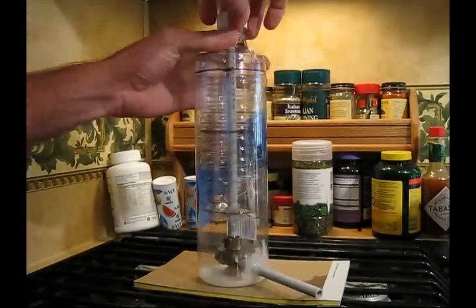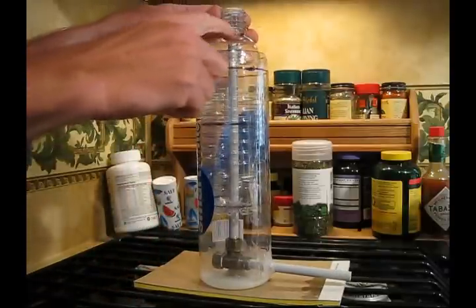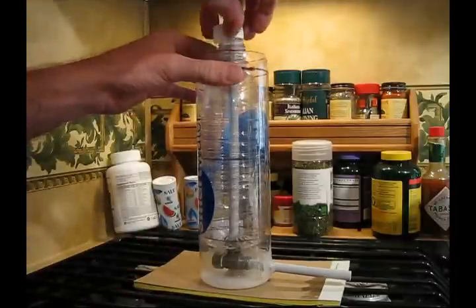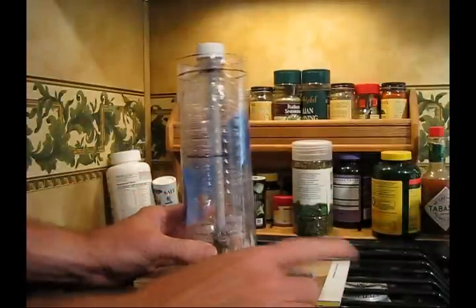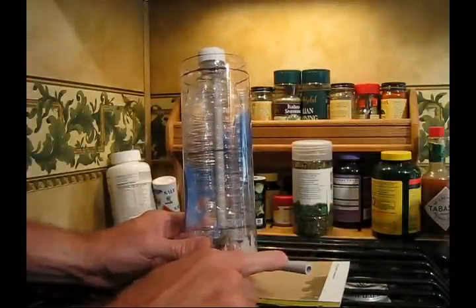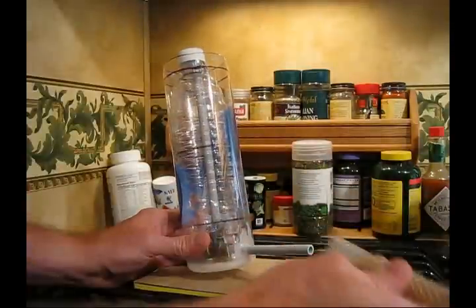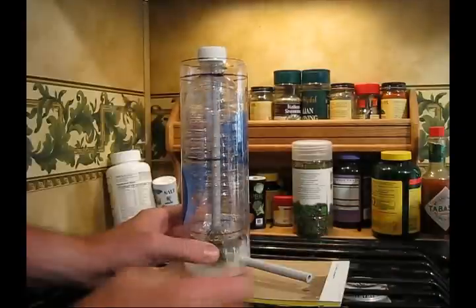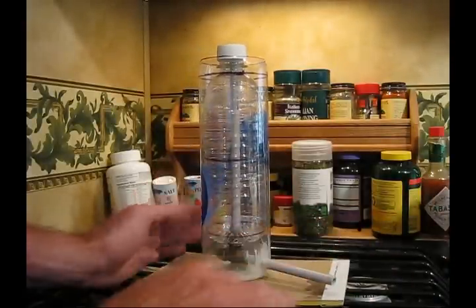What you simply do is fill that with water to this line. The 500 milliliters was actually to the neck, so I just transferred that line to the outside of this. You simply just install the cap, turn your generator on, and measure the flow with a stopwatch. This outside diameter is a perfect fit for inside diameter 3/8 — it's actually a little snug. I just use clear tubing for the flow meter when I'm doing comparative testing.